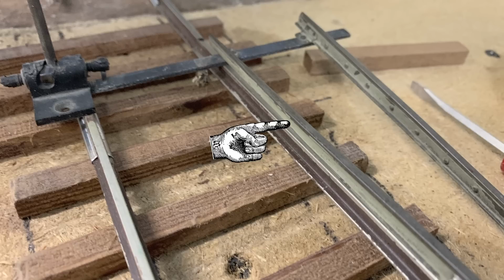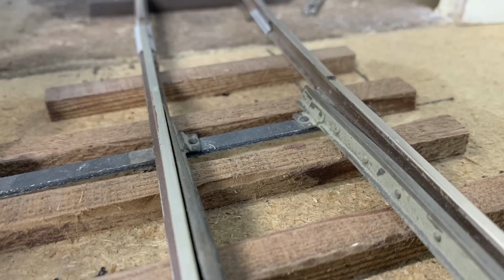So I'm just going to set that up on top of the other rail and then very carefully bend that by hand until the curvatures match. This closure is a lot more tricky than the other one. You don't have the little kink in the rail, and everything has to match up absolutely perfectly. Moreover, as a train is coming through here, the wheels are moving toward the outside. The geometry is forcing the wheels to the outside and up against these points.